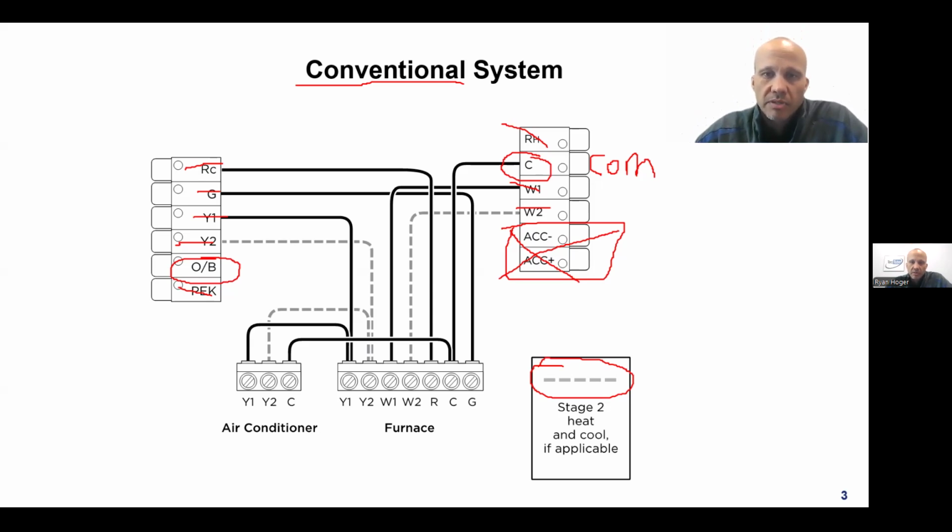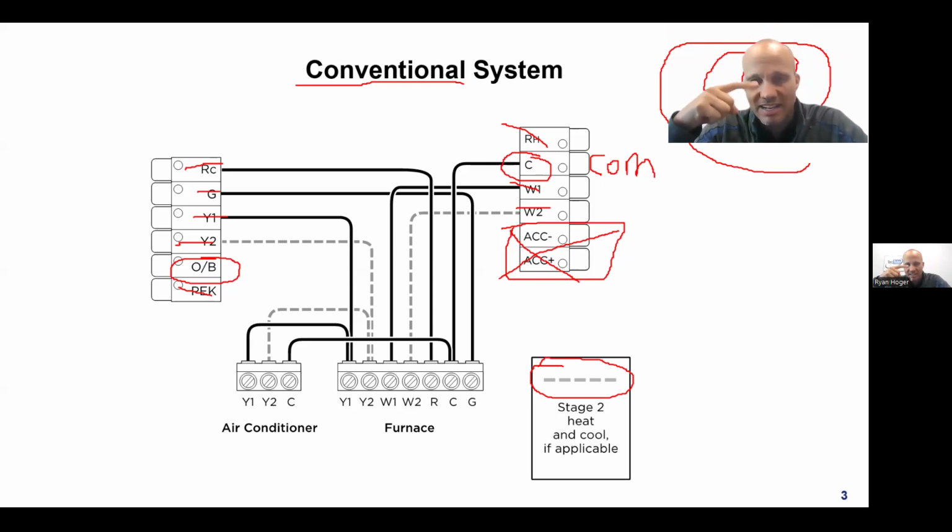So common mechanical ones, if you take the cover off a stat and you see a metal swirling spiral like that, we call that a bimetal stat. Bimetal meaning more than one metal. When metal heats up, it expands. When it cools down, it contracts. So as the room gets warmer, that bimetal spiral starts expanding, and that causes the edge of it to click and touch an electrical connection and complete a connection. So as the room warms up, the metal expands and completes an electrical connection, and then the thermostat knows it's supposed to be turning cooling on, and as it contracts, it completes a different electrical connection, and it knows it's supposed to put heating on.